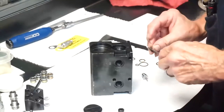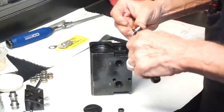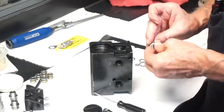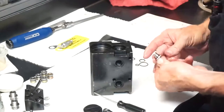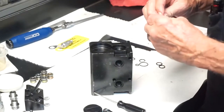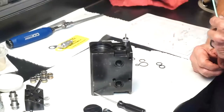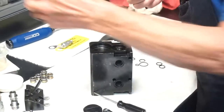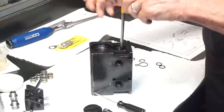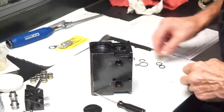Next install the dash 012 O-ring on the pipe, then install the pilot piston. Then install a Teflon backup ring on each side of the O-ring. Lubricate the O-ring on the pilot piston. Carefully insert the pilot piston assembly into the B2 port with the tip of the piston pointing down. Lightly tap the piston into the cavity, being careful not to drive the tip into the check valve disk.